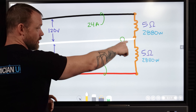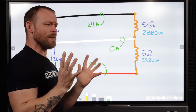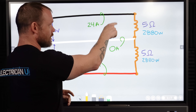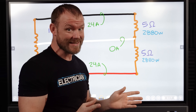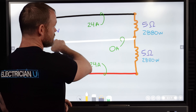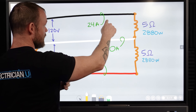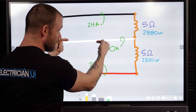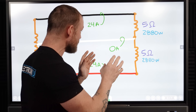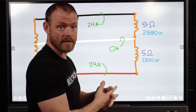The overall circuit is what's going to be drawing current. You're probably saying to yourself like, it's a 220 volt circuit though, so there's got to be a completed circuit through the neutral. If you take your clamp-on ammeter and go across that neutral, there's no current flowing. The amount of current flowing through here is canceling out. So any current coming through here and trying to go through here, current's not going to be able to flow — there is zero current flow — which means current is taking the overall circuit through both of these loads to achieve this.